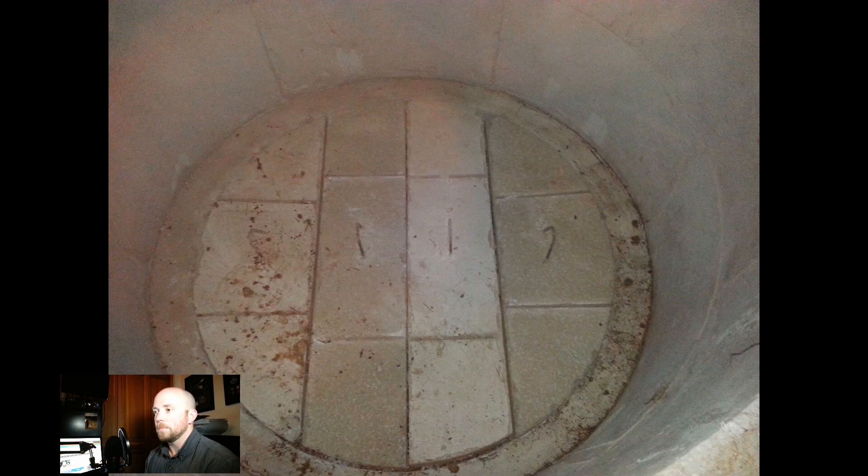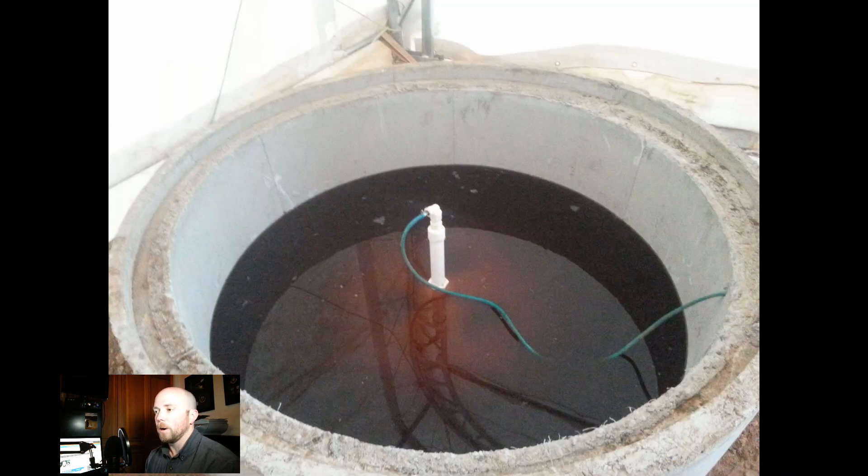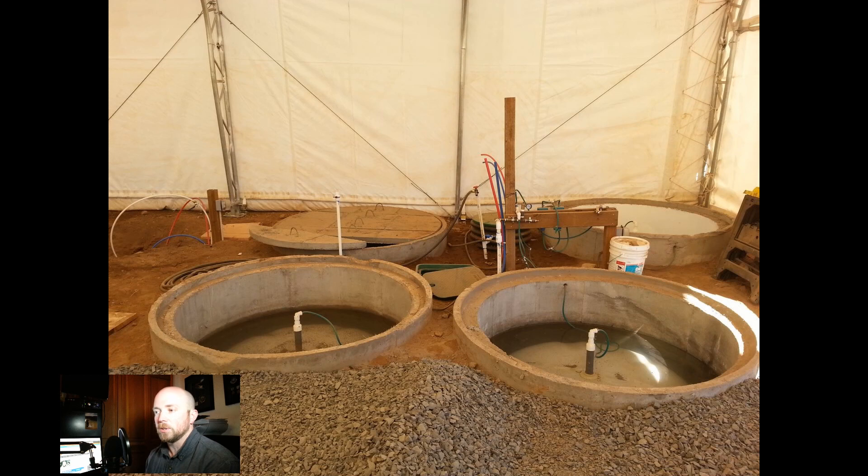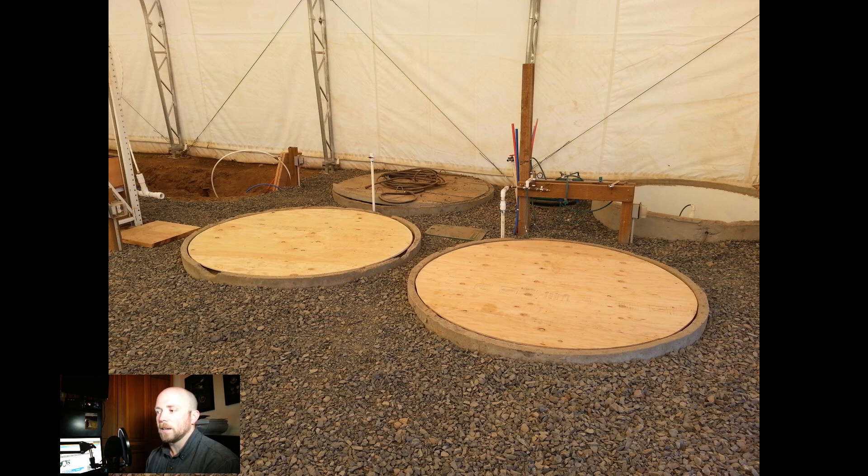Filling the digester took lots of wheelbarrows for the initial load. The PEX pipe circles around inside to move heat. We're covering the neck with cement lids — water and gas can come up between them, so we put a dome over the top to capture it. Methane bubbles up from the bottom, rises into the primary neck storage tank, and is distributed to two additional storage tanks, giving about 250 gallons of slightly compressed methane storage. Plywood and plastic cover the tops to reduce rot from humidity.